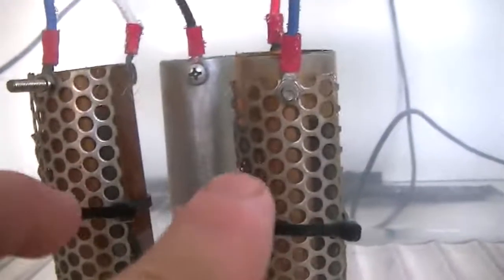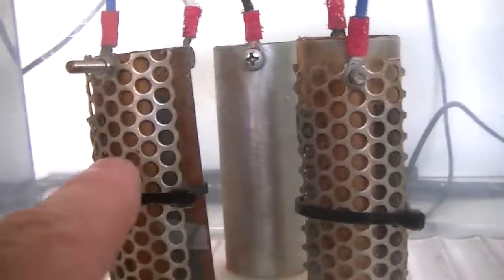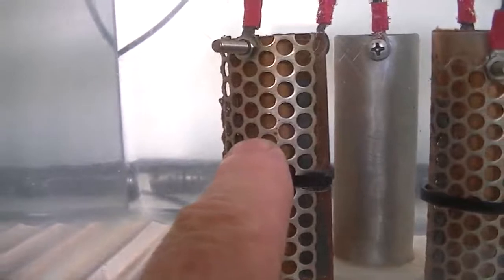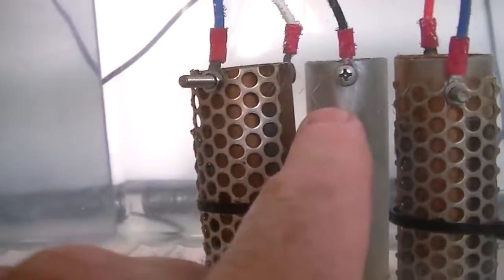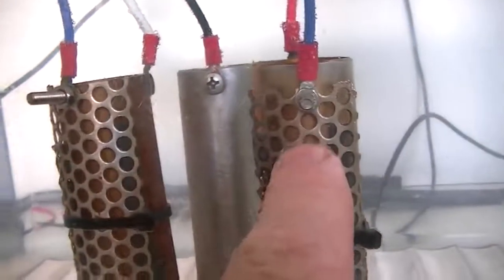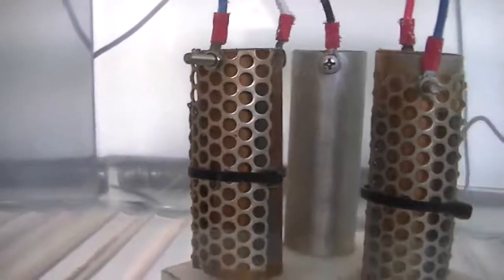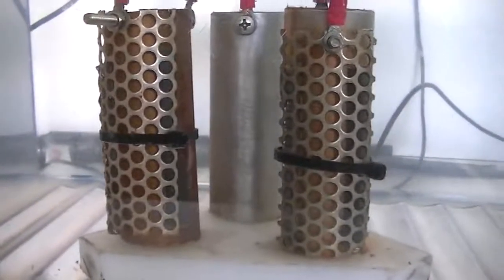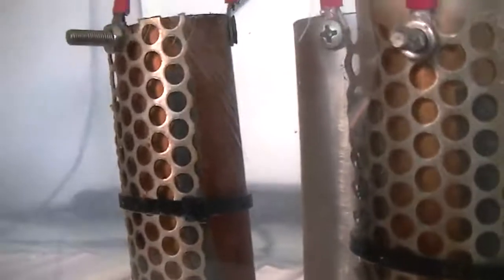This is purely to show us what happens with this cell when it is switched off — this cell then becomes positive and the rear cell becomes negative on the 12 volt side. On the 24 volt side, this cell is the positive, that cell is the negative, the one at the back is off. And as you can see, the cell that switches from negative to positive is the one that is going very brown, very fast.